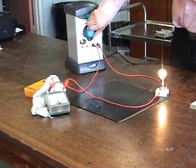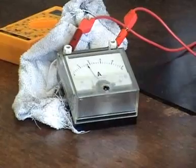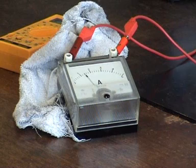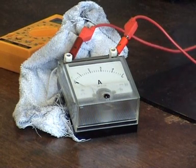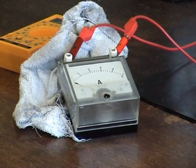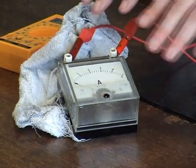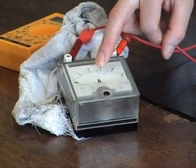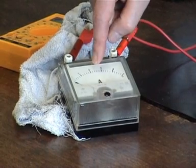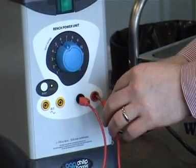One of the things that can go wrong as a student or teacher using an ammeter is that if you have the wires crossed, you're still getting a current — your light bulb is still lighting — but you're not getting anything on the ammeter. The ammeter will only take current going in one direction. So if you're not getting a reading, it could be an incomplete circuit, or the current is going in a direction the ammeter doesn't expect. You can switch the terminals here to fix that.